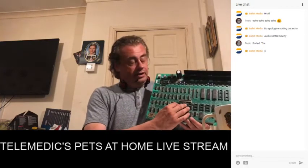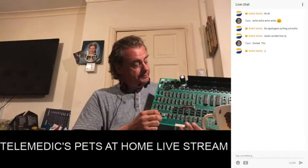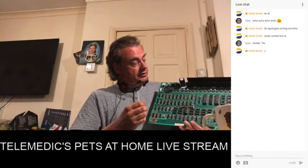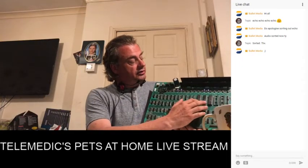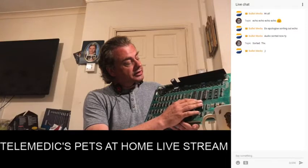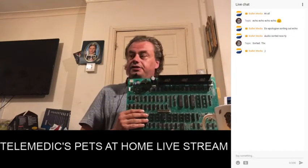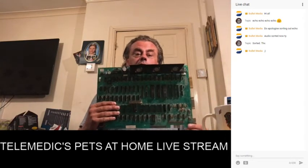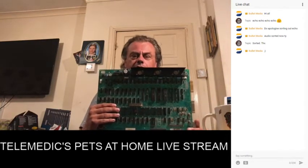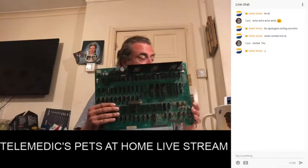The ROMs here will be modified to one large low power ROM, and the rest of it will take as we are. The CPU which I have here, these are lower powered. These are the 65C02. So that leads us to possibly taking the machine faster, possibly up to 4 meg, depending on what I can do. So that's what the plans are essentially with this.